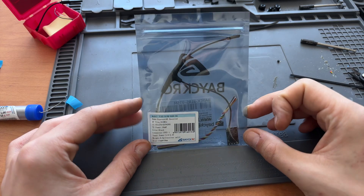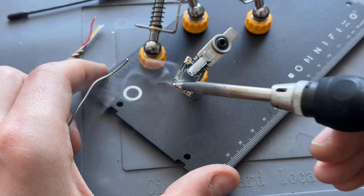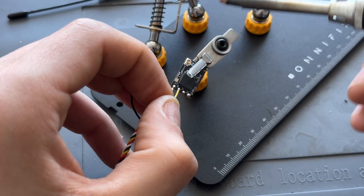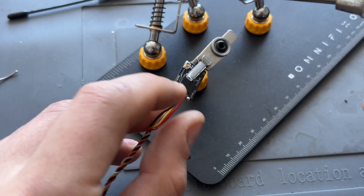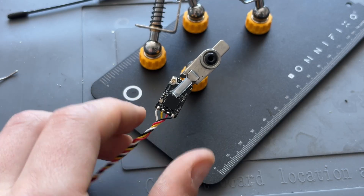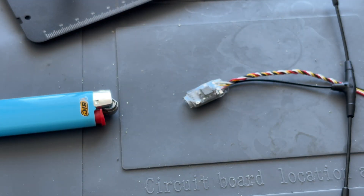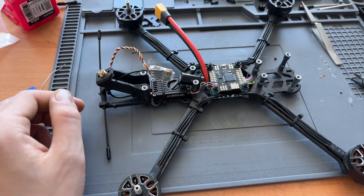It's time to connect the receiver. Unpack it and carefully remove the antenna if it's already connected — be gentle to avoid damaging the connector. The receiver has 4 pins. You can connect the wires in any order technically, but I recommend always using black for ground and red for 5V — such consistency helps reduce the chance of errors. For the signal wires, I suggest using white for Rx and yellow for Tx. Tin the pads on the receiver, then solder all wires. Once soldering is done, clean the board with isopropyl alcohol, organize and secure the wires. Reconnect the antenna and cover the receiver with heat shrink tubing — it's usually included in the package. I recommend using a transparent one so you can see the LED status if needed. Mount the antenna to the drone using a 3D-printed mount or attach it to an arm, just making sure it's not bent and the propellers won't hit it.